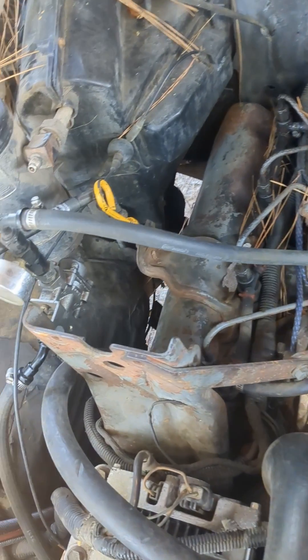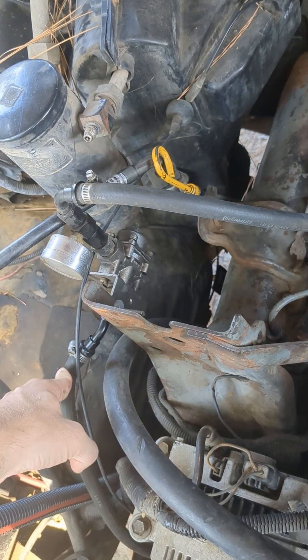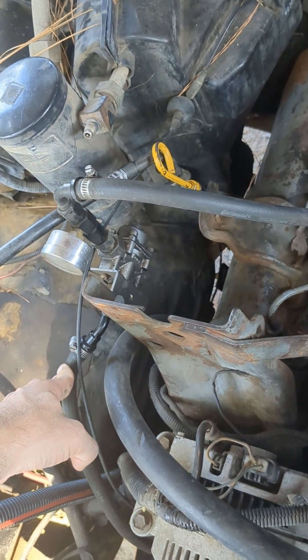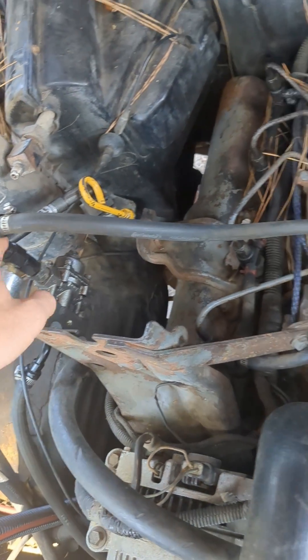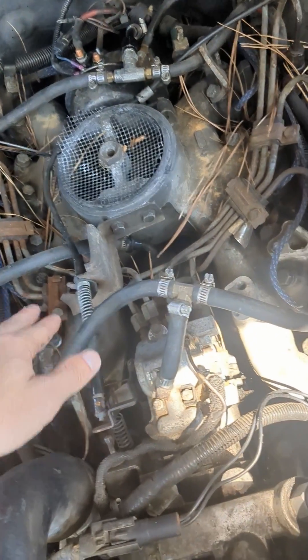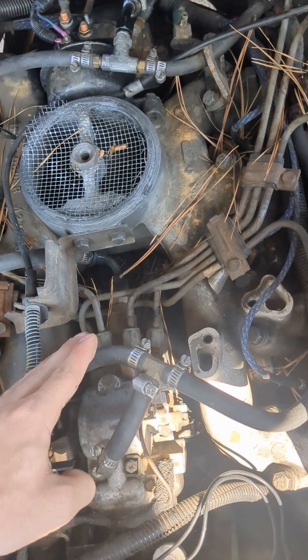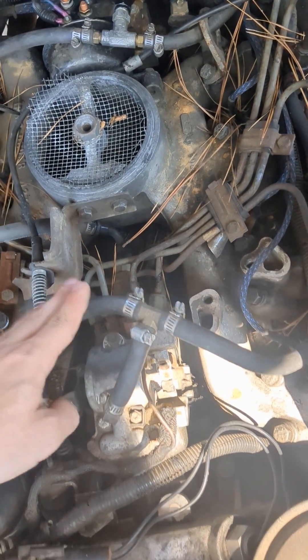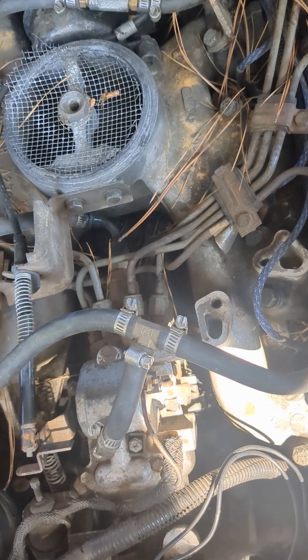This is my mechanical diesel engine. I took off the air cover so it's easier to see what's going on, and this is a non-turbo model. Over here to the side, we have our fuel line running to the engine. This is coming from a low-pressure fuel pump right below the fuel tank, typically between 5 and 9 psi. It's going to run through this gauge to our injection pump. These injection pumps come in two styles depending on your engine manufacturer. You're going to have a rotary injection pump, which this one is, or you're going to have an in-line injection pump.